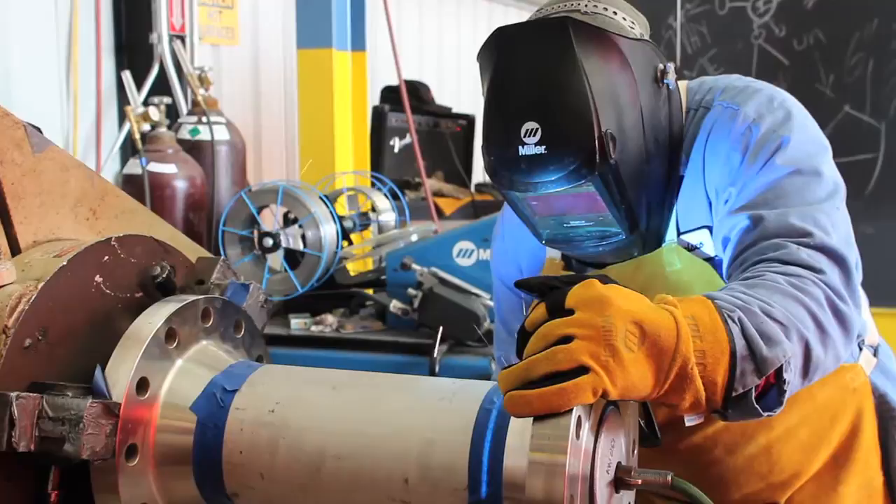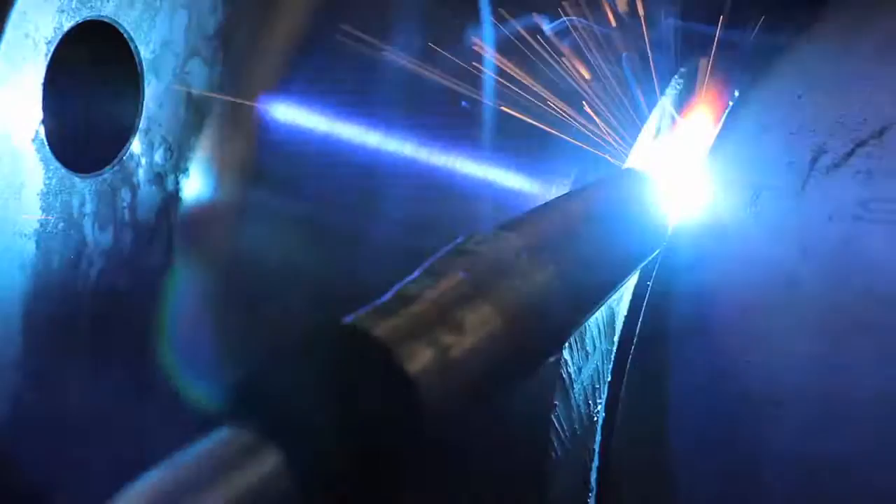It's a lot more user-friendly process. We found that it's a lot easier to teach our welding staff how to use the process — actually riding on the puddle versus trying to stay on that leading edge. We did some test runs, were able to show the client the end product, and we got a uniform root pass in the stainless steel work that we were doing.